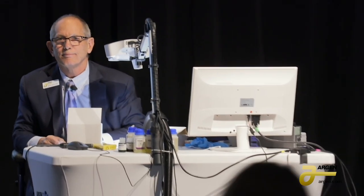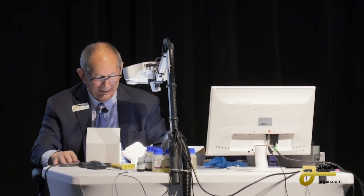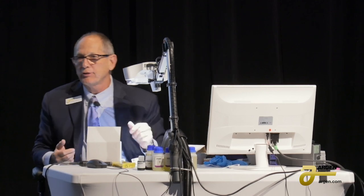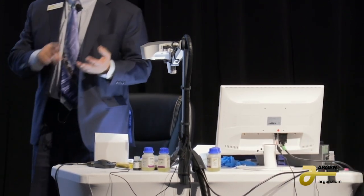Platinum Plus is a hybrid alloy. When you're casting it, the most important things are preheating the crucible and your torch tip position. You hold the torch close — about an inch and a half to two inches — and you want to be in a reduction flame.